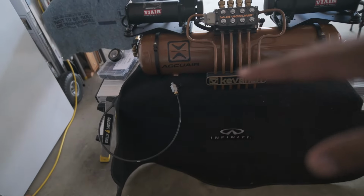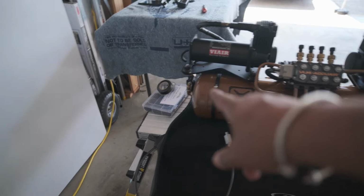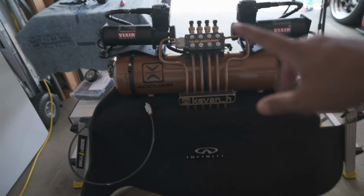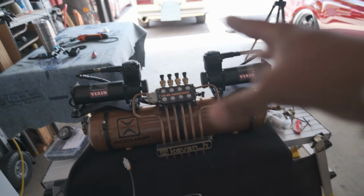Hi, camera. Okay. So we added that 1/4 inch with that ball valve. That ball valve is a 400 some PSI ball valve. Didn't have a drain before, so it really was nowhere for the water to go. So anytime I did any maintenance, there was a lot of water in there. I don't want to have any more corrosion in the system. We do have the water separator that's going to the manifold. So that's always been there. That's always been a good thing. But now we have an actual drain, so it won't back up into the check valves.